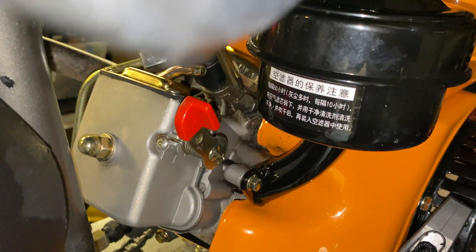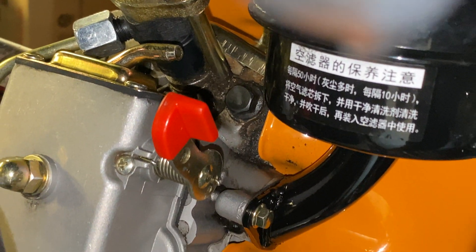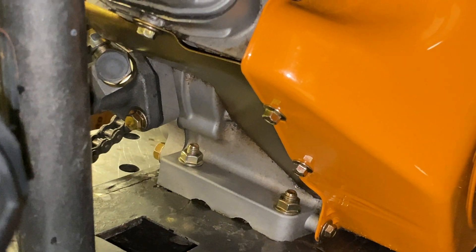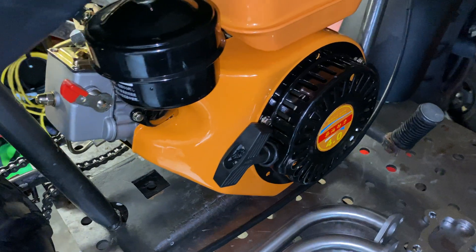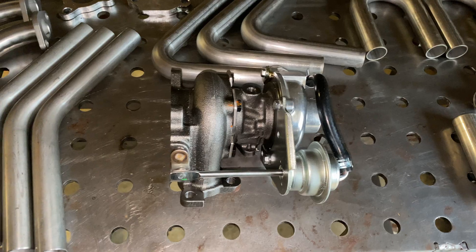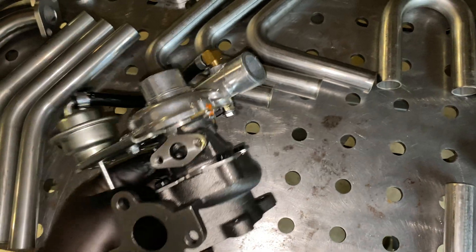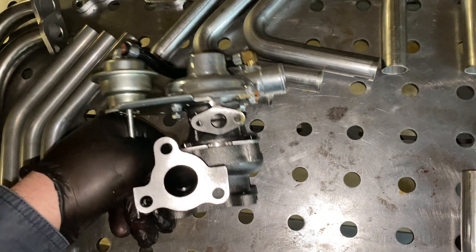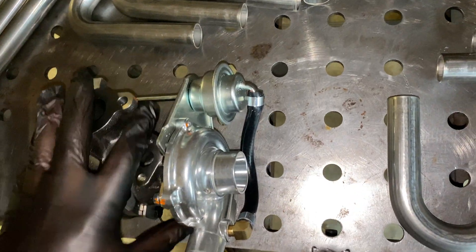Here's a view to the other side. I haven't been able to find any oil pressure port on this engine so I could plumb it to the turbo, so we're just gonna run a separate system just to cool the turbo off. I have two of these turbos — one is water-cooled and one is just oil-cooled, so I'm gonna use the cheaper one which is this one. When we go and build our 10-horsepower diesel lawn mower, I'll use the water-cooled one on that one.